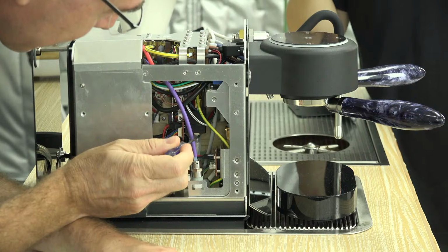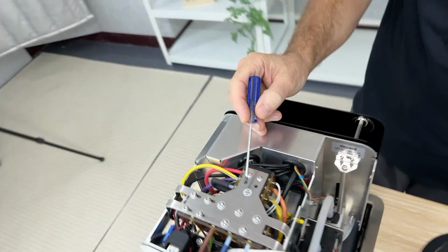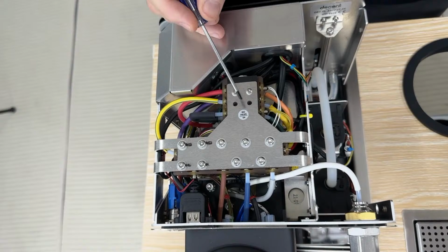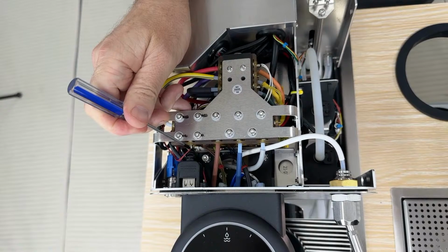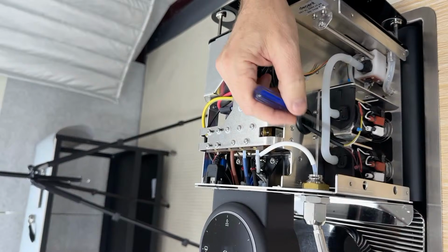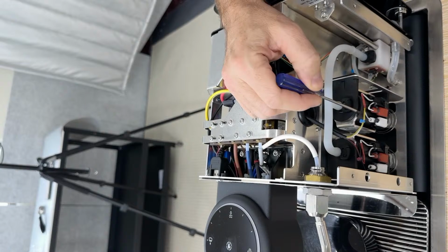So going back here, Paul, you wanna show me that? So this is our auxiliary mixing manifold here. And what we're doing is whenever we detect a temperature here, which isn't what we want, we change the pulses on these. Now, if you're wondering, why are we using vibratory pumps, these things that bounce up and down, as opposed to more expensive pumps that are either gear pumps or rotary vane pumps?